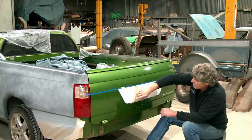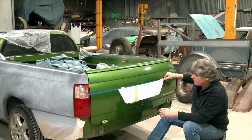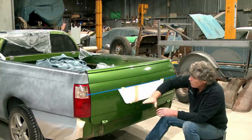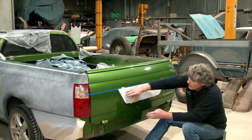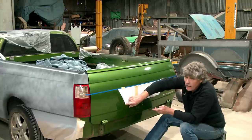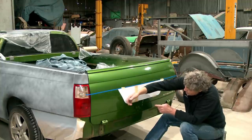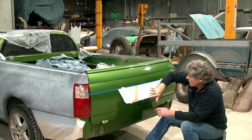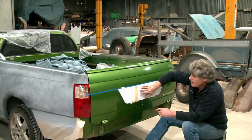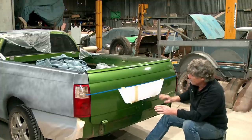but we've only got these two radiused corners. We'll wind up with a little radius in the top up here, and we will fold most of that as a pan. I'll split these corners and then fold it with a bit of an overhang there, and I want to do the same thing again. I will roll the corner up around there, and we will have to just make a little piece to weld in the corners. Haven't thought too much about this piece in here.